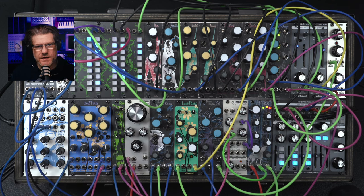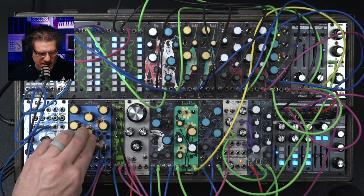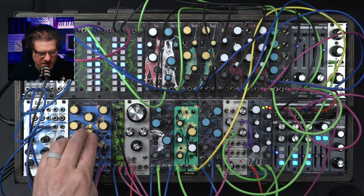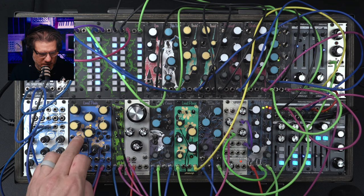What the binary is, it is an analog binary ring modulator. So we're running analog square waves through a CMOS ring modulator circuit that we created, and it just gives us nice and clangy sounds. It's actually something that we used up here in the Narwhal for the cymbals, and I thought it was interesting enough that I wanted to put it in the oscillator.